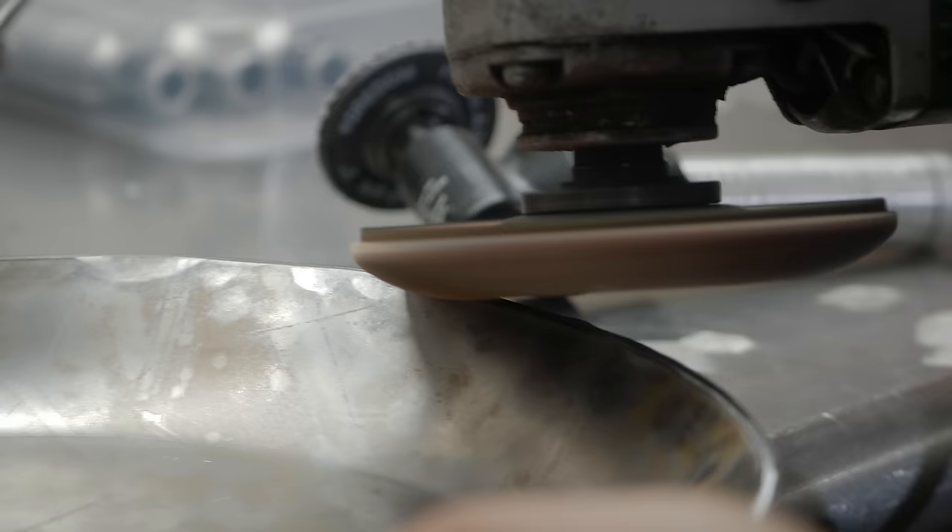Now that we've got everything sanded and ground down, ready to go for handles, the next thing is to take these skillets, set them on this flat surface, and spin them around to make sure the bottom is fairly flat or at least convexed a little bit on the inside. This is really scientific — what we do is turn it over and beat it with a hammer. That one was simple. Now we need to bend these handles to give them their unique shape. We've got this high-tech piece of plywood that we cut with a band saw in the shape we use for our skillet handles — a lot of the stuff in our shop just relies on brute force. We designed this so we can put the handle in all the way, align it, make sure it's straight, and give it a good push.